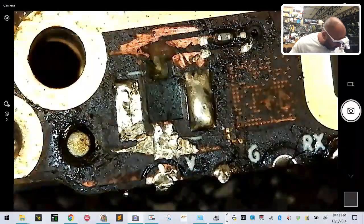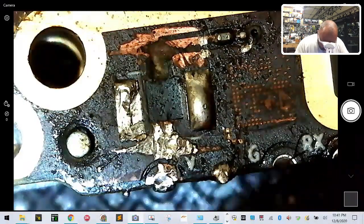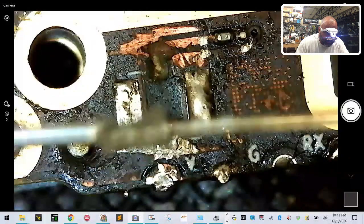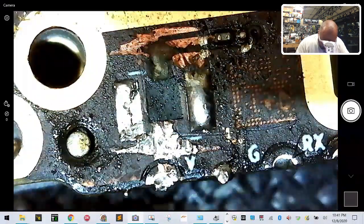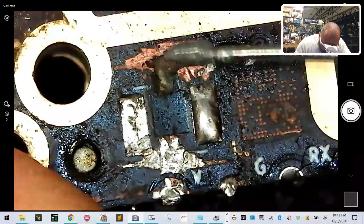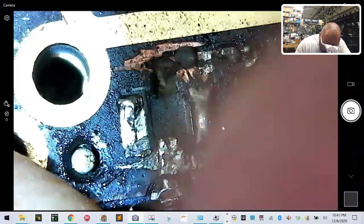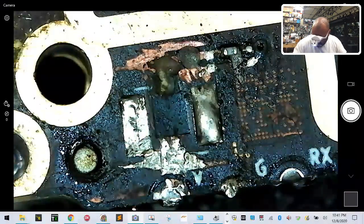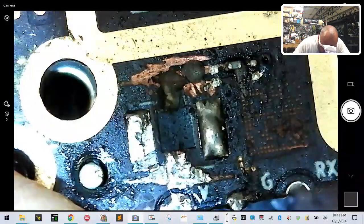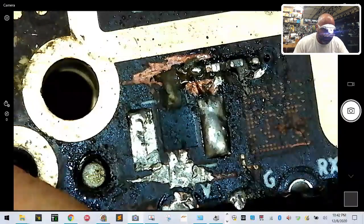Yeah. Okay, now I'm going to put solder paste on the little needle, right? So I'm just going to put that needle in the syringe like this. Let me see if I can show you guys. Like this, okay? And I'm just going to get what I can out of there, and I'm going to put it right on that copper. I'm going to try. And now I'm going to try to hit that with the solder. Try to get it to bond. Only the middle piece. And I think we just did it.